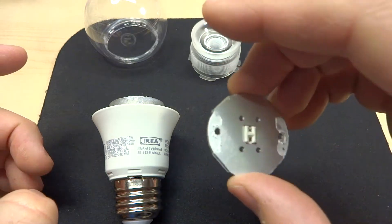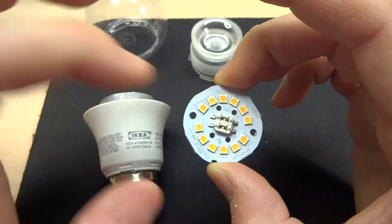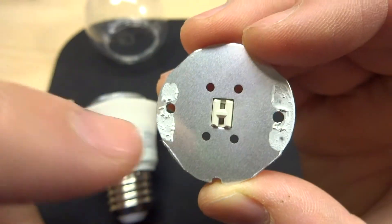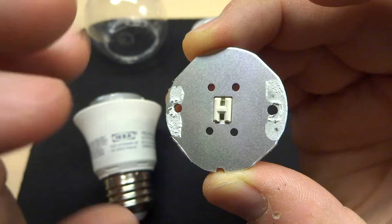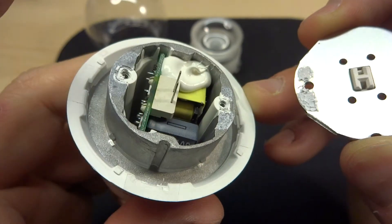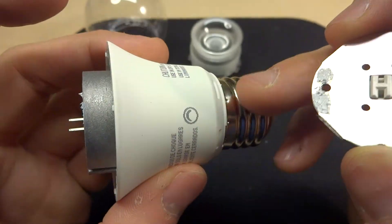The construction is really nice — IKEA or Intertech actually put a connector on the LED board, so there's no soldering required. You just remove two screws and that's it. This is definitely a metal substrate board. The only part of the board that contacts the base is a small area, but from a heat dissipation standpoint they've clearly tested it. And they've actually applied thermal compound there, which is fantastic — the LED board transmits heat directly onto the lower metal base unit.